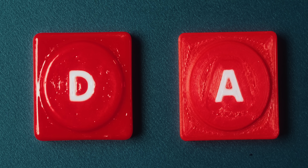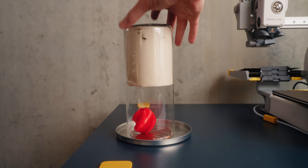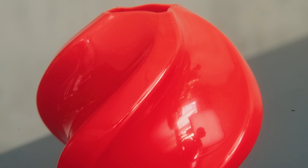Here you can see how big the difference is before and after. After a good amount of experimentation, I can tell you that 60 minutes was the sweet spot for me, but this really depends on how much acetone you put in the jar and also on what you're printing, so you might have to test it yourself and figure it out a little bit.